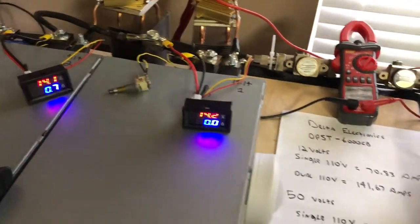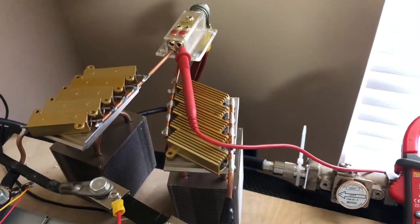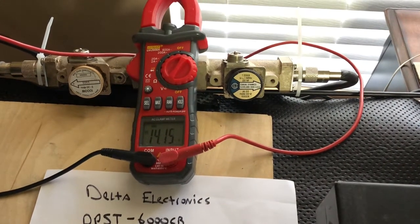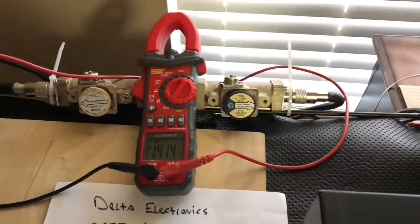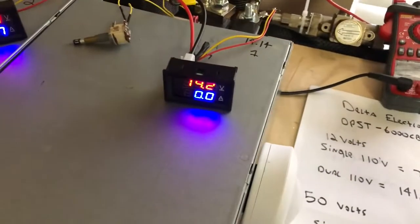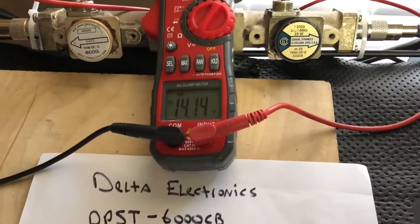No voltage change on this side, but look at the volts on the far edge — this is what the load is actually getting. The power supply is providing its voltage, but going through the network you get a little voltage drop and some heat dissipated. Dead key then audio again: we're at 14.14 volts, and we dropped about 0.6 to 0.7 volts — didn't drop more than a volt. We're at 14.2 and 14.1 on this side.